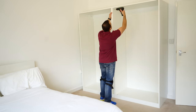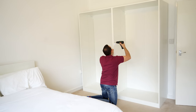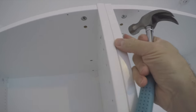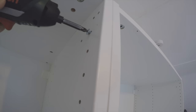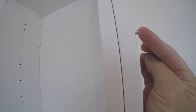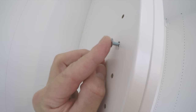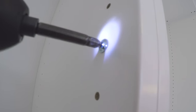We're gonna drill three holes — one on the bottom, one in the middle, and one on the top. In this case the frames are already lining up nicely on carpet. If you have a problem where your wall is U-shaped and the back of the wardrobes are splitting apart, you can put another joining screw on the back to connect it from the back side as well. Since we have sliding doors, we don't need to worry as much about where the three joining screw holes go. If you have hinge doors, good practice is to put hinges on a door, check where they go exactly, and drill the holes between the hinges. If you have drawers or shelves, check where those components go and drill the holes between them, otherwise you'll interfere with holes for hinges, drawers, or shelves.